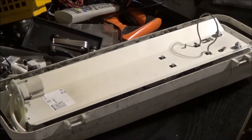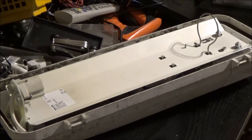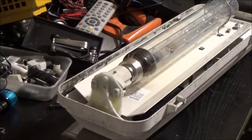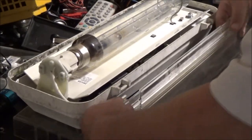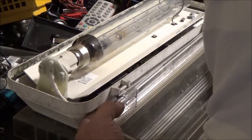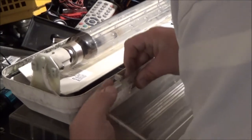This panel is earthed, by the way. It wouldn't take a lot to convert this to use an ordinary light bulb — you could use the photocell where it is and basically take out the igniter, ballast, and capacitor, and just bypass it if you so wished. We're going to put in our bulb. It slopes downwards, so ideally that'll make life easier to get the canopy on. The My Hermes courier wasn't too impressed as he had to drag this up two flights of stairs, but it was very well packed.